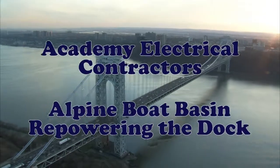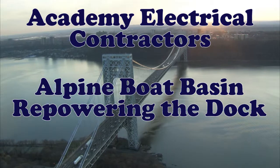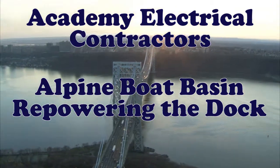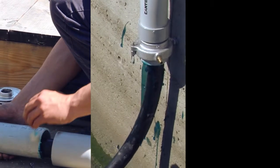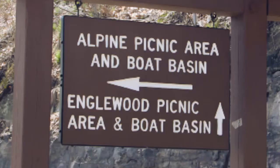Academy Electrical Contractors was called in by the Alpine boat basin to repower the last of the docks that were damaged from Superstorm Sandy. The work consisted of running a new PVC conduit, installing a heavy-duty cord to feed the sub-panel on the dock that would refeed the power to the boats.